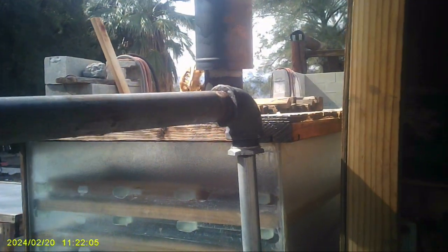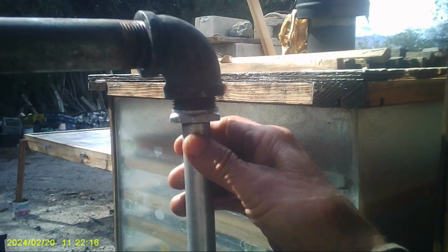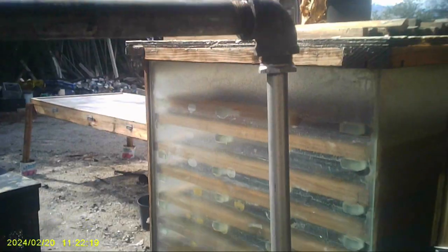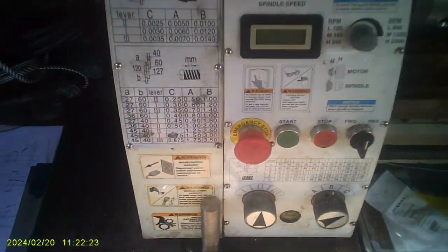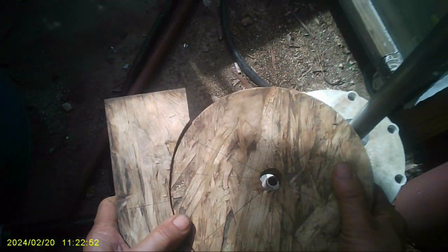This turns still, but it doesn't change anything because one goes up, one goes down, and the shaft turns freely — I can't really tell any movement here. It's doing good, so we're ready for the next step. I need some kind of way to stop this, because when it gets going and if I have to adjust something, I'll need to be able to stop it. I'm going to get this thing inside there and it'll be like a brake shoe — I'll weld some kind of bracket, and I'll be able to brake it like an old wagon wheel.